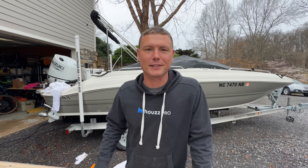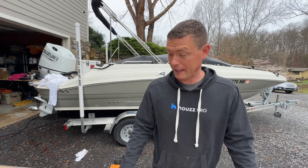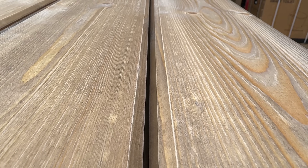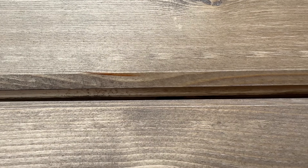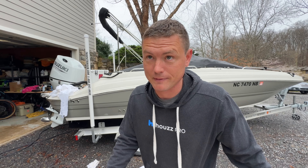Jamie wants to tell you about sanding boards. I want you to look at these boards that are sanded and prepped for their second coat of polyurethane. Ray pointed out these little marks down the edge of every board in the same place — what I think it was, was some sort of drive mechanism that shoves it through the planer or molder that cuts the tongue and groove. They have to grab that board pretty tight and shove it through these machines, and I think it actually compressed the wood grain where it's grabbing and feeding it. Then when we're putting product on it, I think the water-based stuff is actually having a swelling effect on those places where the wood grain is compressed.